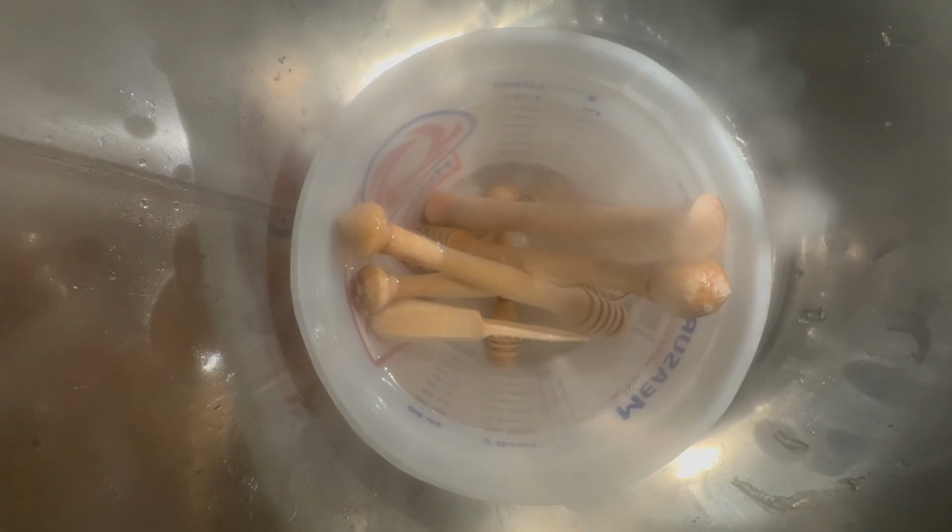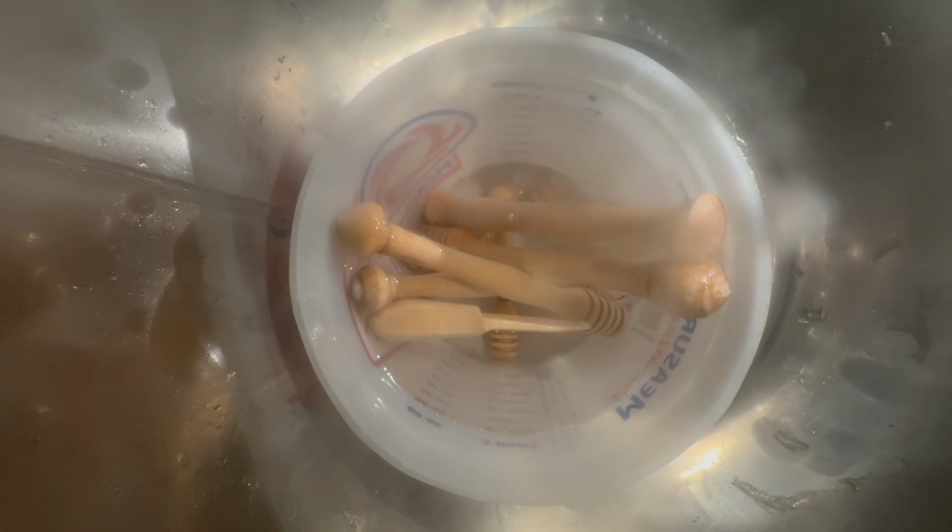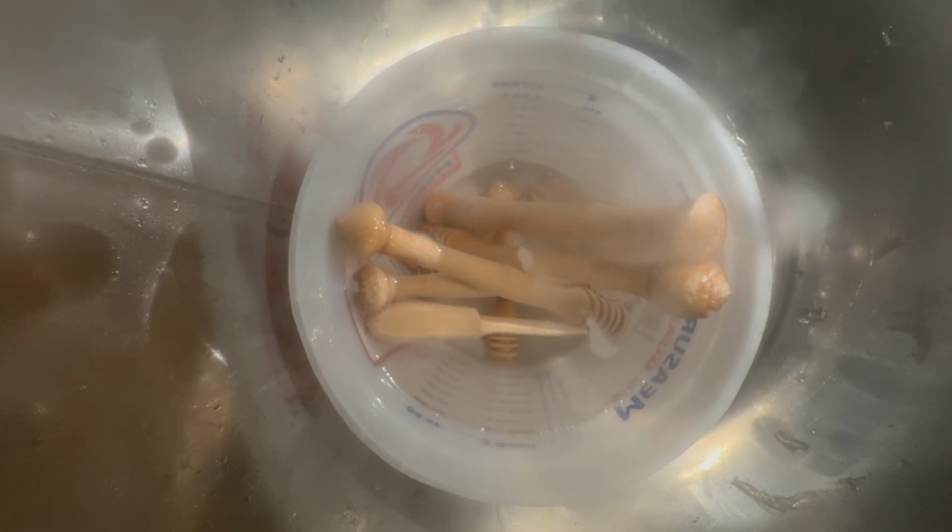17 inches of mercury. We're still pulling vacuum. There's 20 inches of mercury. The most I've seen this one get to was 29 and a half, or 28 and a half, almost 29. There's 24 inches of mercury right there. We're still not getting any new bubbles. And it might not bubble up at all if I did this right, but I'm starting to see them pop up now.